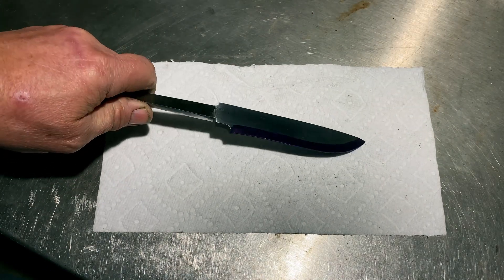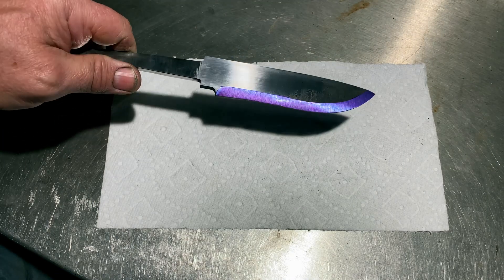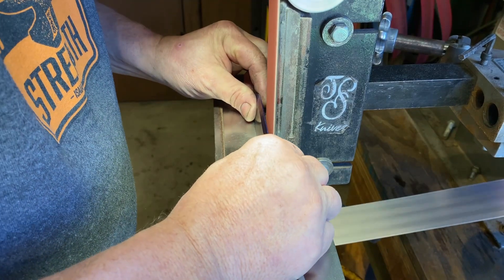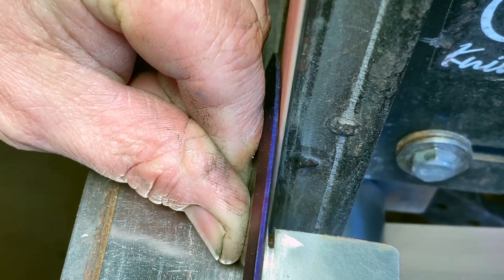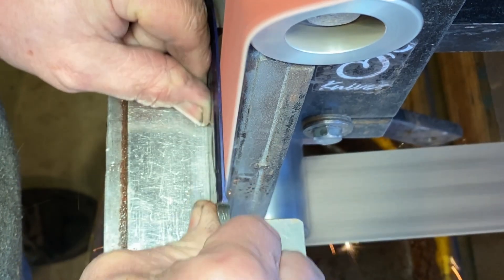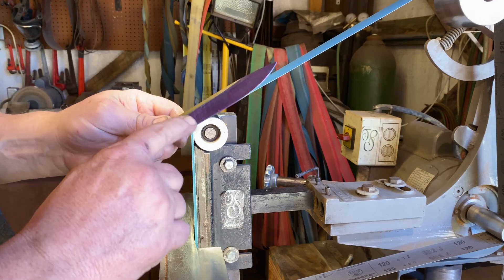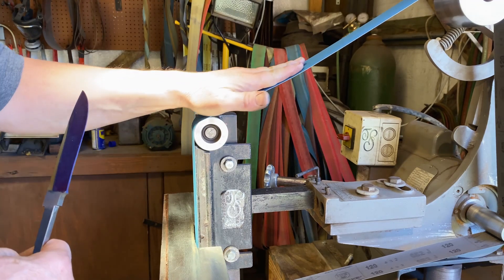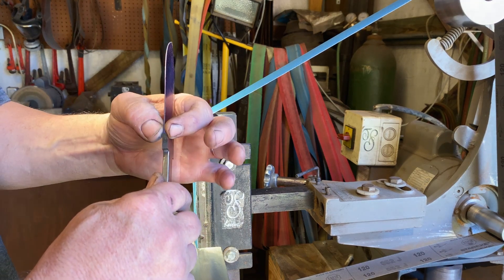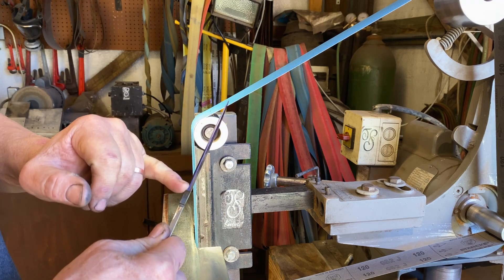With the plunge lines established, we can go ahead and start grinding our bevels. Before I start, I'm going to come in here and mark this primary bevel where we established our plunge lines, so I can chase that line all the way to the center mark and visually see it. I'm going to start with a 50 grit belt. Since I've already heat treated the blade, I'm going to be running it slow, barehanded, and keeping the blade cool. In between each grit I like to come in and mark the blade so I can see any scratches left behind. Now I'm putting on a 120 grit J-flex belt so it'll flex into the plunge lines, true them up, correct any slight over-grind, and get them nice, smooth, and clean.